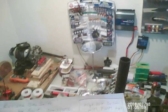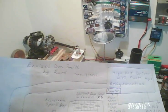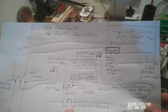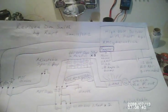Briefcase driver — the coil directions I showed. It's basically adjustable: you can adjust where you want to clamp the coil. I'm using a 37 and a half turn primary right here. Probably don't need them all — I can take this one off and it makes no difference. A couple of ceramic caps, 40 kV, one and a half nanos.